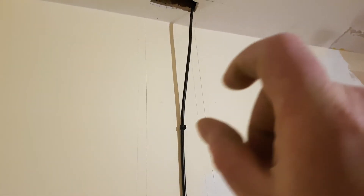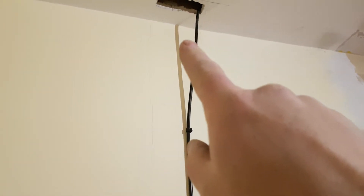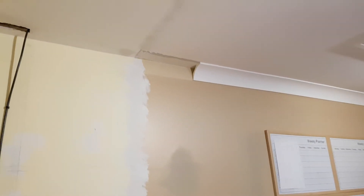What I'll do is put a two-by-one on its side as I said, and probably some three mil MDF or ply or something like that, and we'll make a little rebate in it so the cover will slot into it, with a few panel pins to hold it in place. I'll paint this the same colour as the wall.